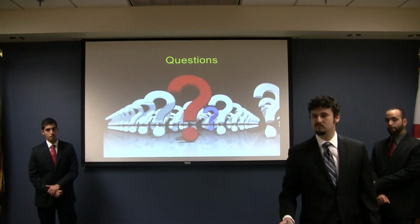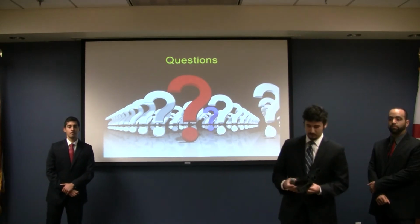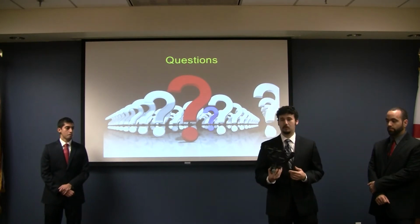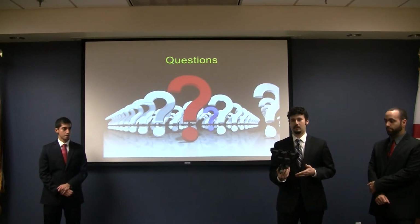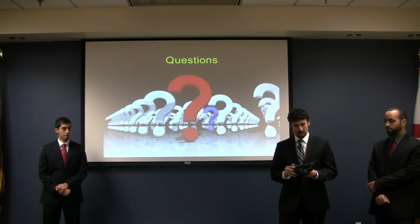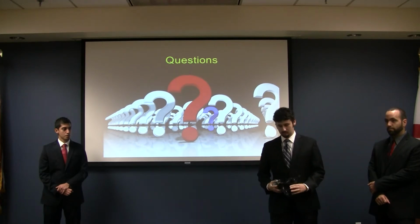Well, I mean, that design is a little different than what you modeled. Oh, right. Because I see a structural member down the center. Once we contacted the company that was going to print it for us, their build area wasn't big enough to get this in one piece. So all we did was we chopped it in half and put a flange in the middle to glue it together. That's the only change. And in the end, it ended up being a good thing because that flange gives it a lot of structural rigidity since we're supporting this carburetor on the end of it.